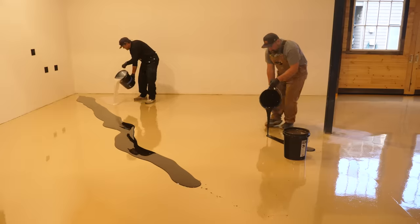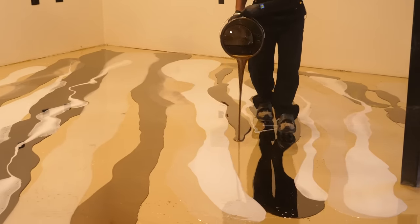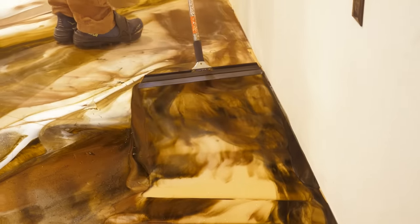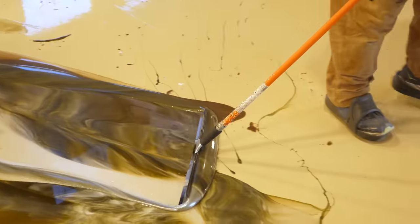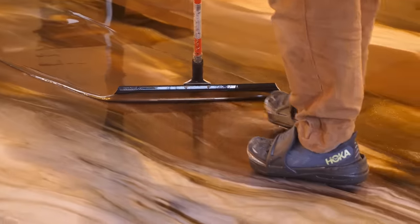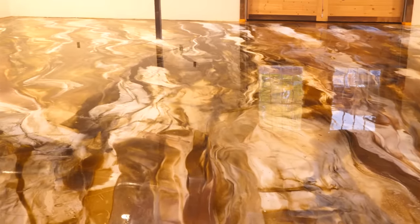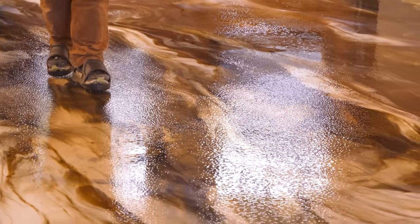We're experimenting with a new floor style for this spacious area. Our client desired a marble floor with a seamless flow, and with multiple colors, to prevent them from blending excessively, we poured wide ribbons of each color. Then we followed that by using nine-inch rollers mounted on poles, gliding the colors over one another, resulting in a breathtaking marble effect without creating a muddy appearance. After melding, we followed up with a gentle misting of 91% isopropyl alcohol from a pump sprayer, which effectively eliminates any trapped air bubbles while adding a captivating veining and lacing effect. Throughout the installation we applied the alcohol about three to four times, ensuring a bubble-free finish.